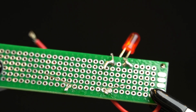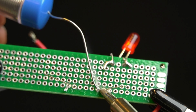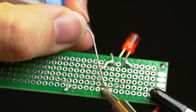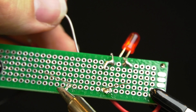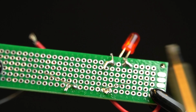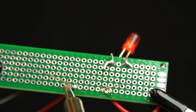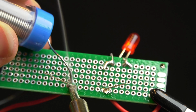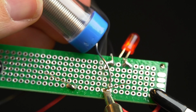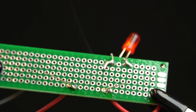Now that they're bent, we'll take the soldering iron, and you want to touch the legs of the resistor and the point on the circuit board, but not necessarily the solder. You don't want to melt the solder with the iron. You want the solder to melt onto the component and the board, because they have to be hot enough to melt the solder so that they'll bond. Really, you should just touch the point for a second or two with the soldering iron and then touch it with the solder. And it should, if the iron's hot enough, melt to the component wire and to the board. And then release, because you don't want to damage the component with a lot of heat.